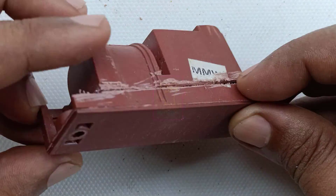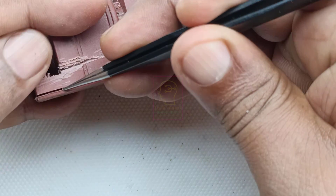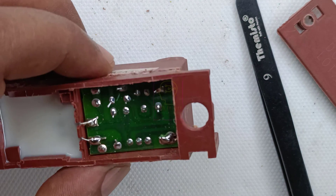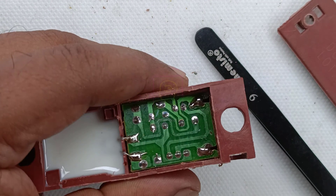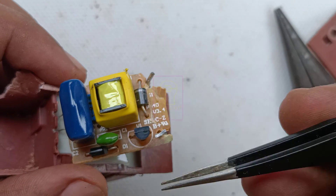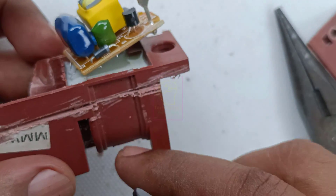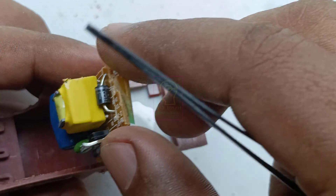The two connections are going inside that white part, which is very strong. Inside that white part, most probably a Tesla-type coil will be there — a choke coil — which generates high voltage. It was closed like a molded one but can be split open using a utility knife to split the bottom part. The circuit is soldered to those two points, so you must desolder it rather than push it, otherwise it will break.